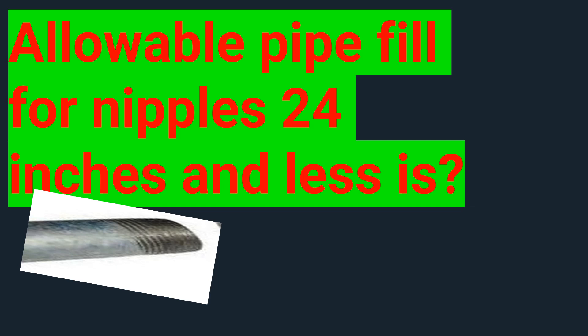That's a very cool set of tables. If you've never seen it before, it covers pretty much every type of conduit or raceway. It's going to tell you the allowable fill — 100%, 60%, and 40% respectively, depending on what area you're in. In this case we're dealing with 60%, so let's find EMT. Read across the top of that black bold heading and it tells you the fill percentage for EMT. Then find where it says 60% and go down and tee off with your size conduit.